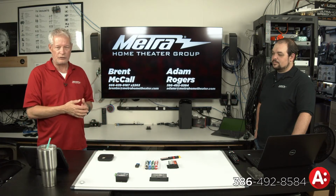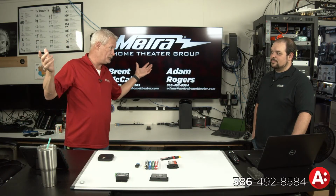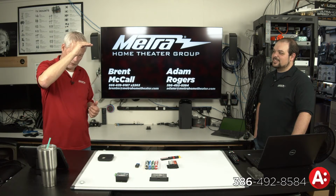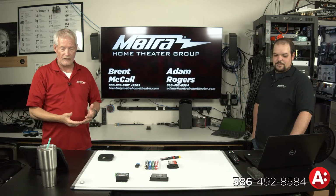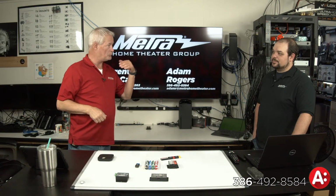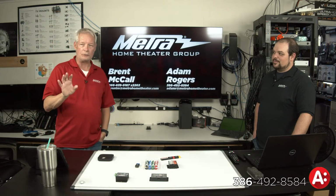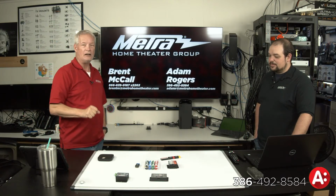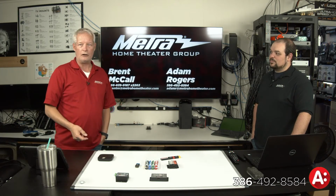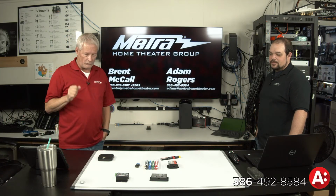Those problems traditionally come down to a rise time issue. Now, rise time is simply, when you're looking at data, ones and zeros, the infamous ones and zeros, how long it takes to transition from a 0 to a 1 or 1 to a 0. That is called the rise time. The rise time is very critical because when that gets off, you miss the bus. And when the bus gets missed, there ain't no ride. No picture, no sound. Sound is the first thing to fail on purpose. It is the dashboard idiot light. Literally, that's its intent. When you have no audio, that is HDMI's intent for you to know there's a problem. So it's a good place to start.